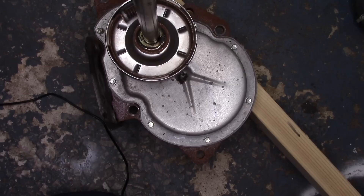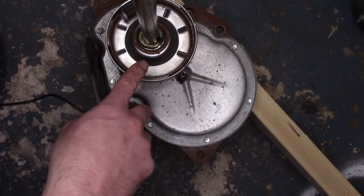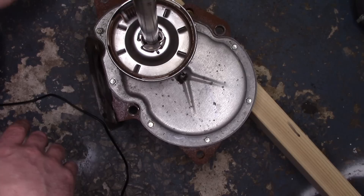As long as the oil isn't contaminated with water, I'm going to leave it all in place. The first step is to remove the transmission from the machine. I take a 2x4 and lay it vertically — it gets the perfect height so the machine sits pretty level. You want it to be level because once you take the cover off there's oil in there, and if you're crooked the oil is going to leak out. We're going to start by removing the clutch assembly.